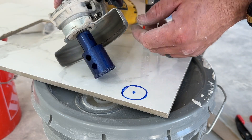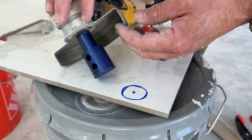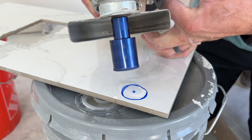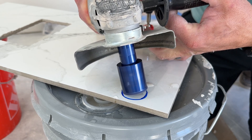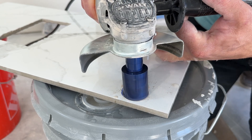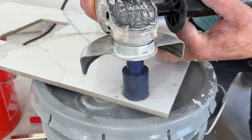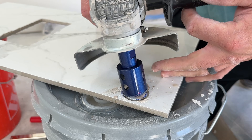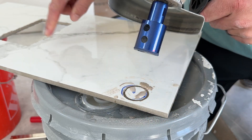If you're going to do this with a hand drill, make sure it's on the high RPM — level two. Make sure it's going very fast; you don't want to go too slow. That's why a lot of people who do this daily use a grinder because it has a lot higher RPM. Stopping halfway through to show you — see how we let it walk in? I'm not applying any pressure, just using the weight of the drill, letting it sit down. We can already see we have a really clean edge and we're not getting that bad breakout.